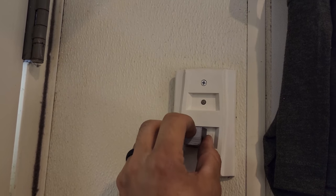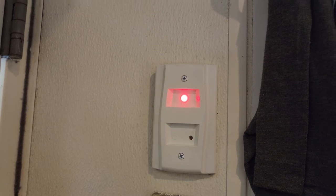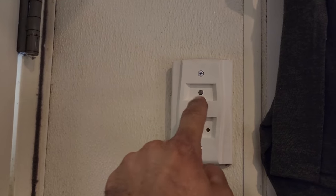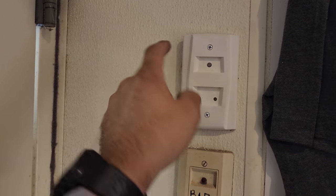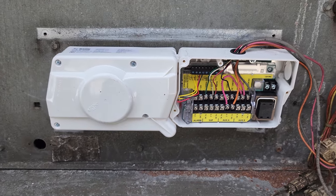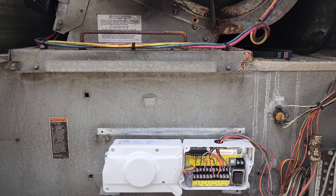We should be able to trigger it with the magnet from the test and reset station — there we go. The fire alarm should be going off, but it's not, and then we reset it by pushing that button. So we know it tests and resets from up here. I always leave the magnet up there for the fire inspector. We put it back in alarm condition to verify, then reset it. The blower should start back up — there goes the blower. We know the emergency shutdown and operation is working.